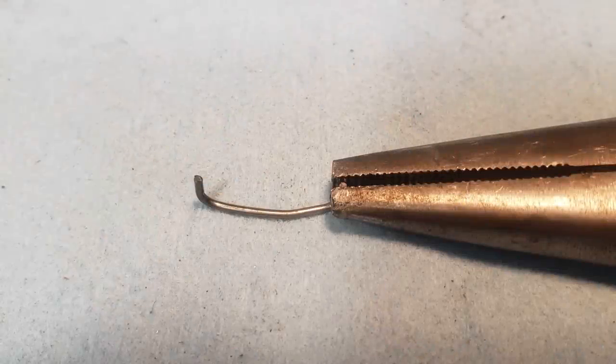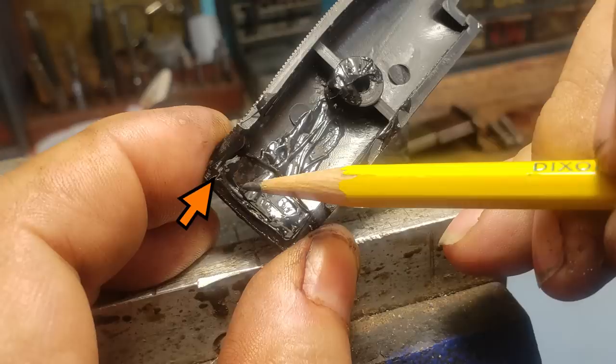So I took a piece of wire and bent a small curve in it with two hooked ends so that it was possible to just lay it across the gap and it fills in inside of this Acraglas. It's underneath it, the pencil's pointing at it, and the arrow's telling you where it is. It's a dog bone with no deep cut. This way, when it all sets up, we bridge the load across the gap so it'll have less of a chance of breaking this time.